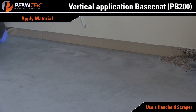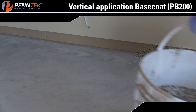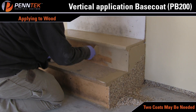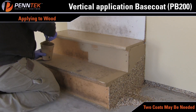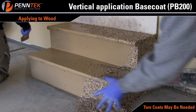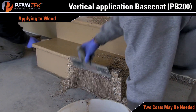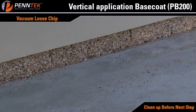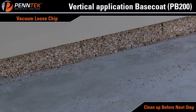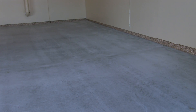Re-apply material to the same section and apply chip immediately. If coating stairs, wood, or concrete, apply material in the same manner and scoop chip into wet material. Wood will soak up more material faster than concrete, and two coats of material may be necessary for chip to adhere. Once all verticals have been coated, vacuum up loose chip and finish any remaining prep work.